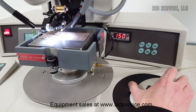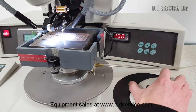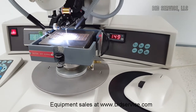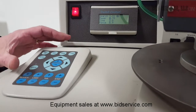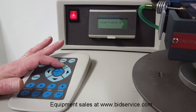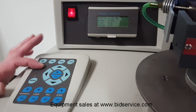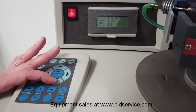Search one, bond one — we're at loop. It did step back, but now you can reposition if necessary by using the Chessman. Press and hold for search two and then make your second bond. In order to load a program that's been saved, you can hit the load button and cycle up. I have one saved — that was program two. We can go to program one and hit enter. Now we have different parameters. You can save up to 99 programs on this machine.